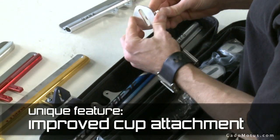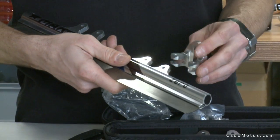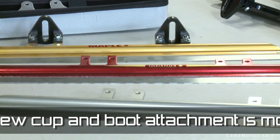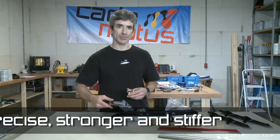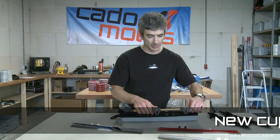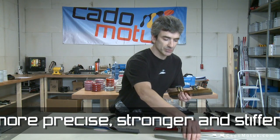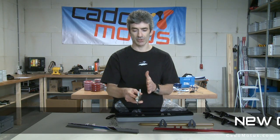The second feature on these blades is how we've decided to attach the brackets, or the cups, that mount onto the blade. Typically they're done on a pair of posts, both front and rear, but this has always been a very compromised attachment system from the very beginning. For years it wasn't a very weak point, until the radius and the bend of the blade started to become more refined. As that became more precise, this attachment system began to become a limitation. They don't bolt on very precisely — they can move side to side, they can be positioned this way, and because of how the tube is extruded, sometimes these posts are not even aligned properly, 90 degrees or parallel to the steel.